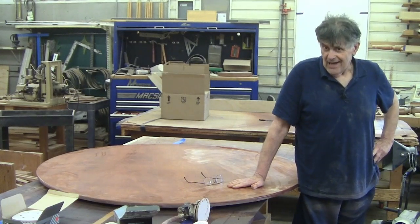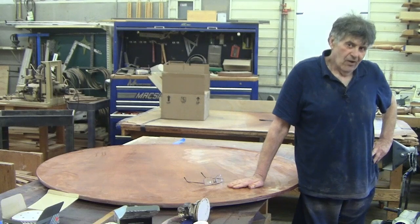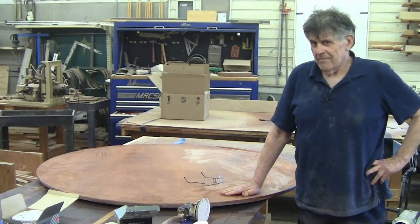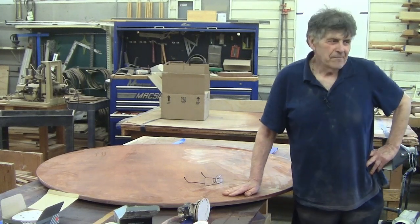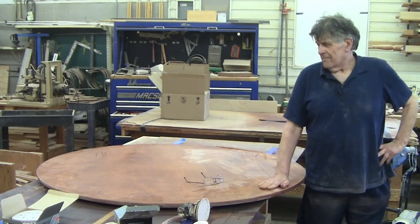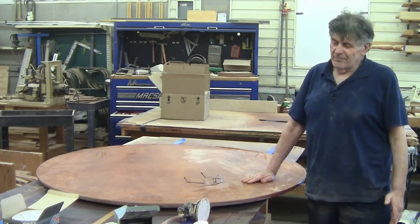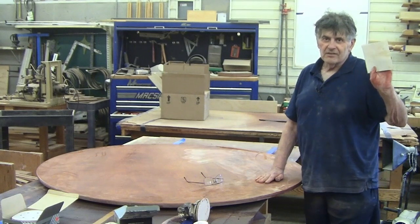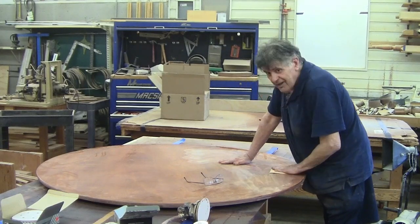Anyway, everything except for the conference table has been sanded, dyed, and has a heavy coat of sanding sealer on it. We're now going to scuff them and glaze them, start to finish. I know everybody out there, when you're scuffing, typically you're going to take a piece of 320. The Rhino pads from Industrial Abrasives, the best there is. You get on here and you start scuffing. Works great.